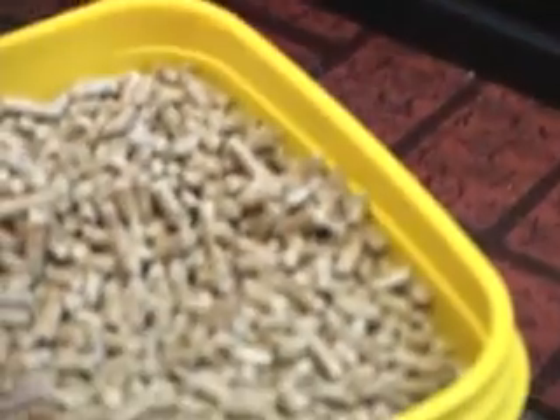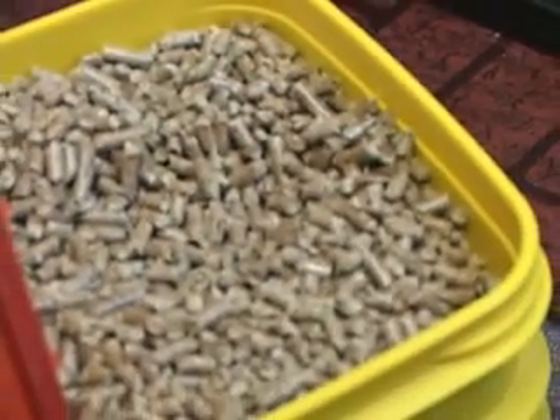It's always good to use wood pellets to start it because corn has a high flash point, so it's good to use some wood pellets in there. My favorite way is to take 91% alcohol, take the pellets and soak them in a can - soak them down really well, shake it around, let it sit a couple hours, maybe soak it again. That will absorb the alcohol and those pellets will start immediately.